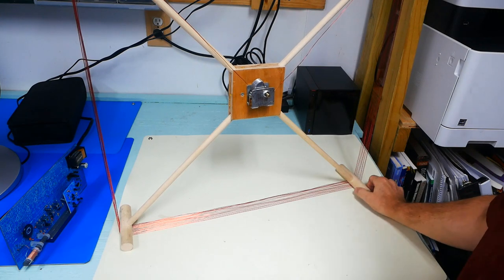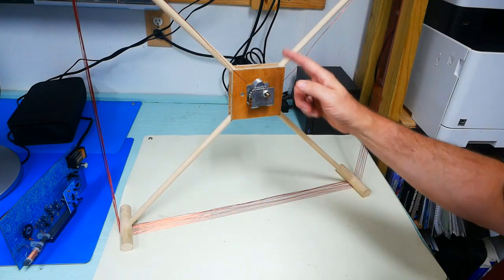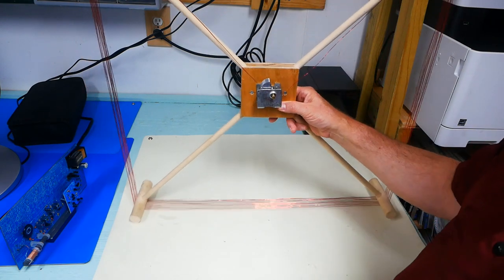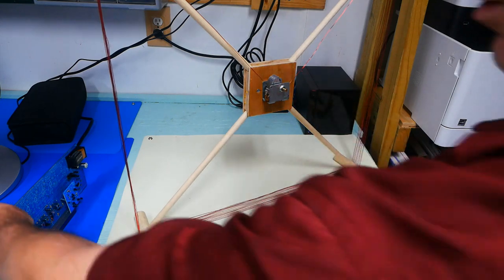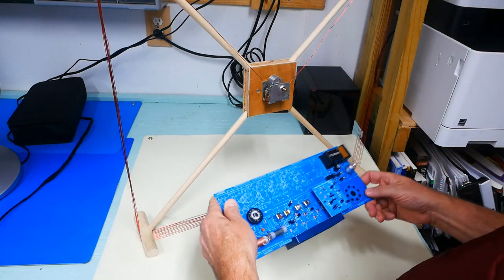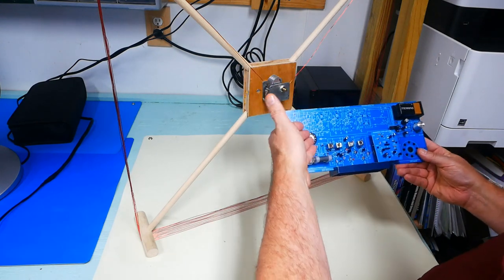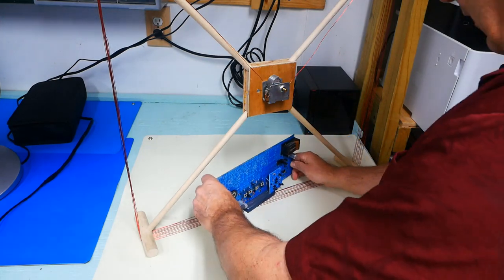So, build a square, 2 feet by 2 feet, wrap wire around it 11 times, leave a little bit extra to go to the center, find yourself an old radio tuning capacitor, and you have an antenna amplifier. Remember, this is a directional device, so you kind of have to point it towards wherever your station is. And one of the things that you might want to do is, if you take the time and go through here and find stations on both of these dials simultaneously, make yourself a little dial so you can tune in a little bit faster and don't have to wait.